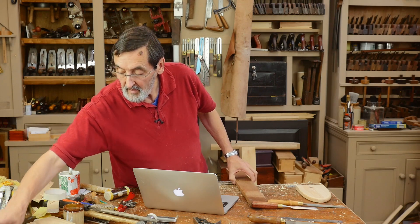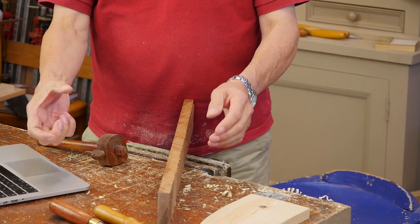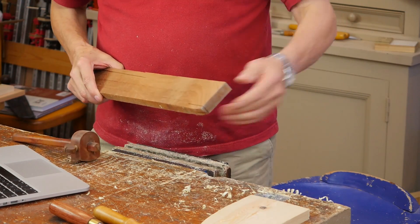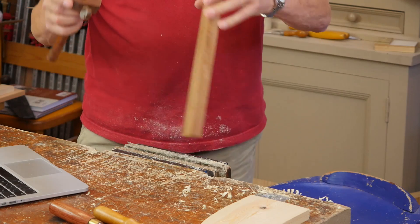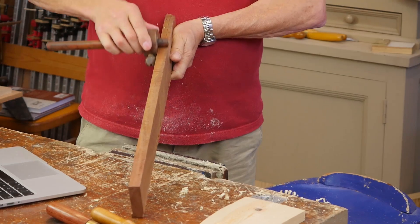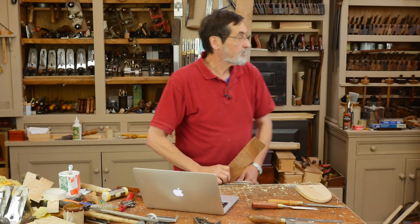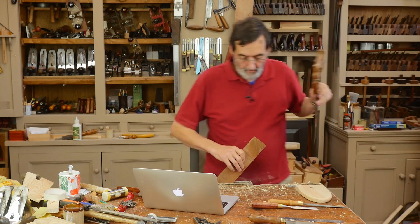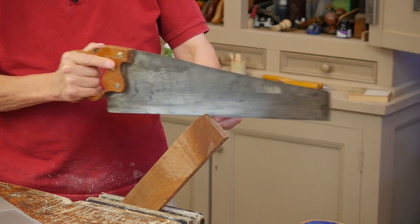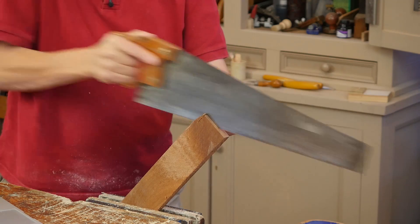It's very simple. Whether this is an 8-inch wide piece, 10-inch wide, 3-inch thick — you use the same method. Plane up your first face, then set your distance on all the outside faces and work along those faces. Then take your saw depending on which type you want to use. These are your tools: your plane first — saw down this face, square across that end.